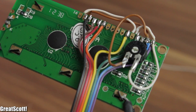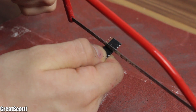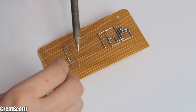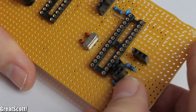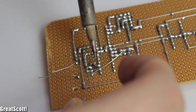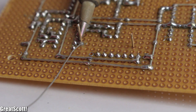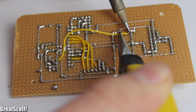Finally it is time to build the PCB — well, almost. Before that I made some female headers which will later connect to the external parts. I did not make a board layout diagram, but it is not that complicated to build the board yourself. You can use my finished board as a reference on Instructables. All you need to do is inspect the schematic and carefully connect all the pins of the components as the schematic tells you. I mostly used bridge wire and solder traces to connect the pins, but at the end I also used wire where it wasn't possible to do it otherwise.